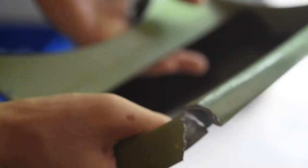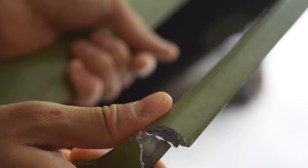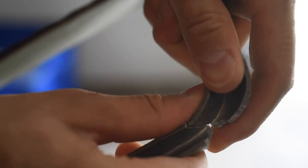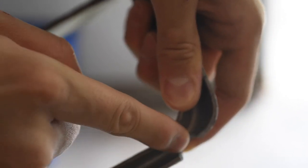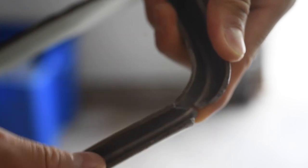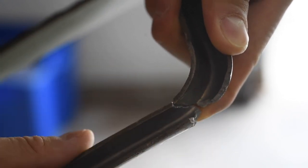This is the broken section of the frame. It's cast aluminum, so it does not like to bend and it does not like to weld. It's very difficult to weld aluminum, mainly due to the aluminum oxide which melts at a much higher temperature than the aluminum itself, making welding difficult — especially with that big missing chunk. My thinking is that since this entire area is hollow, I can just fill it with fresh melted aluminum, which will both fill in all the gaps and crevices as well as reinforce the entire piece.